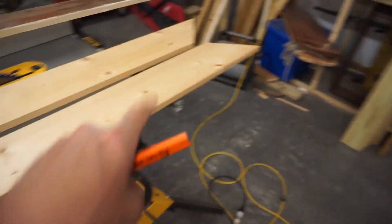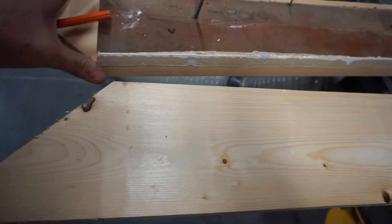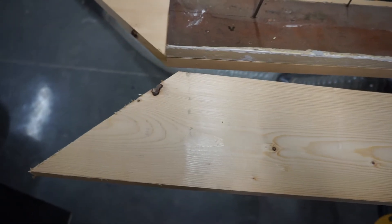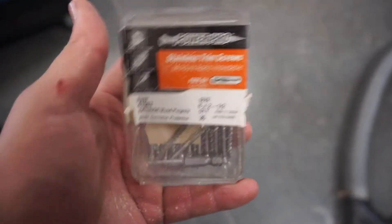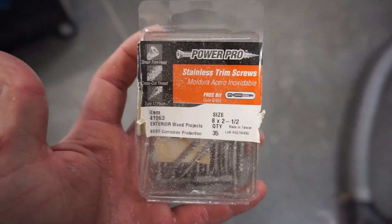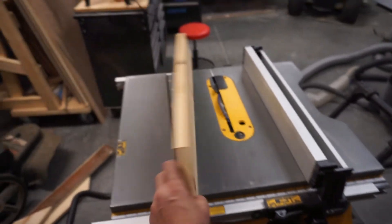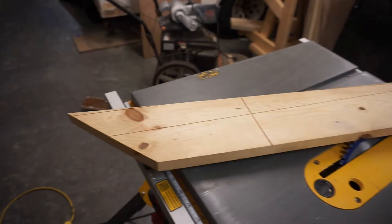See if it's the right length. Right there — corner. And corner. Score. To make everything really pretty we got these finished nail heads, little tiny ones that kind of sink in there. Should be nice. Last piece of trim — this is where the hinge is gonna be. In order to make it nice and perfectly fit, do a little relief cut.